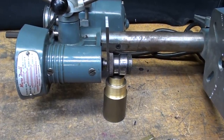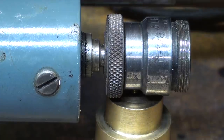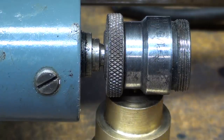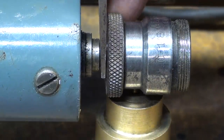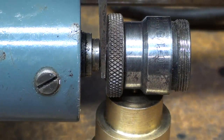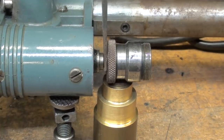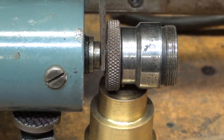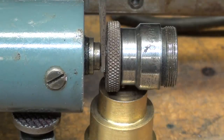I have this little press sitting on its side, and upon examining it, there's much less space in here than there was on the other one. In fact, not room for two wedges. One wedge barely starts. So I'm going to tap that and see what happens. I think I have it well supported, because I do not want to bend it. If I bend that taper, I really bend the spindle. I don't know whether this is hardened or not, but it would ruin the whole machine — and I'm sure a new quill would be too expensive. So let's see what one wedge does here.